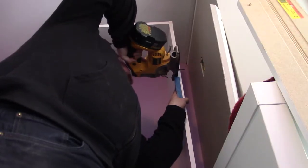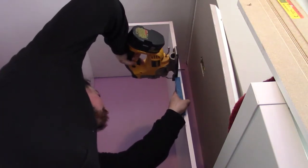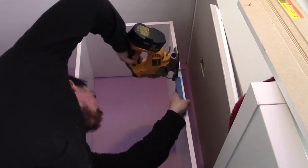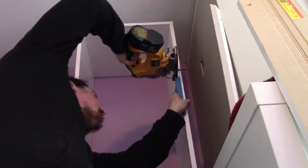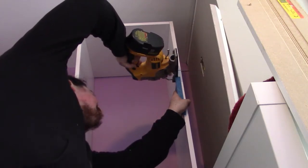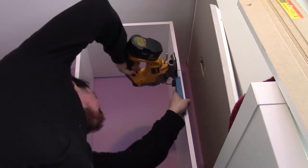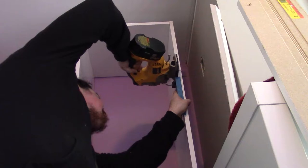Back in the house now, before I can bolt the cabinets to the walls, I have to modify the one cabinet going into the right corner. Back when I built the front closet, I needed to add this junction box to avoid doing a lot of rewiring, and unfortunately the cabinet will be covering it up as is. Though this is pretty easily fixed with some measuring, marking, jigsawing, and then throwing on some edge banding.